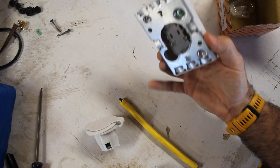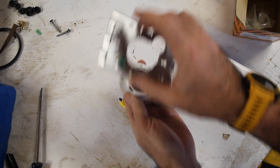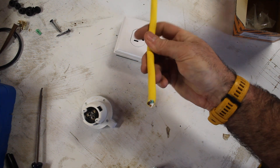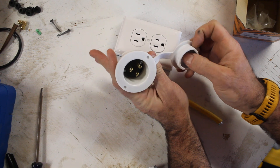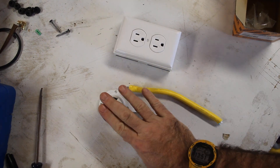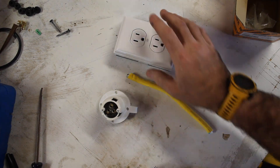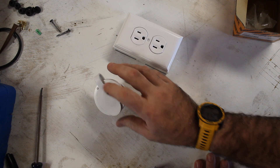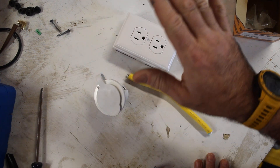The things we'll need for today's project is a flush-against-the-wall outlet, which I've already drilled a hole in the back to fit the back end of the plug, and some flexible 12 gauge wire. It's 12 gauge because it's going to be up to a 20 amp circuit, and then a weatherproof receptacle for the outside of the trailer. I'll also be using some butyl tape and wiring this up ahead of time so I can just feed it through, attach it to the side, and mount it on the inside. That way we'll be able to plug in our trailer to a 20 amp circuit as well as the 30 amp circuit, so if we're camping in the winter we can run a heater inside off of this and everything else in the trailer off the 30 amp.